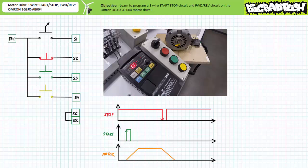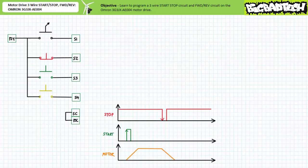Let's put this circuit to the test. Given the frequency adjustment knob on the digital operator group is pegged fully clockwise, when an operator presses and releases the start button on input three, the motor drive increases applied voltage and excitation frequency — the motor accelerates and speed stabilizes despite the operator having released the start button. The three-wire start function maintains the last asserted state and continues to operate in constant speed mode. When an operator presses and releases stop on input two, the motor drive decreases applied voltage and excitation frequency, and the motor decelerates and turns off. If an operator presses start and then presses stop prior to completion of the acceleration period, the motor drive overrides the ongoing acceleration and initiates deceleration. Without rewiring, we've fundamentally changed this system from one that does not maintain the last asserted state to one that does.